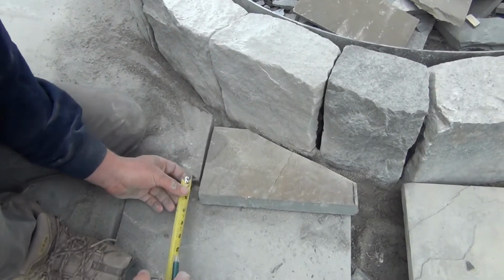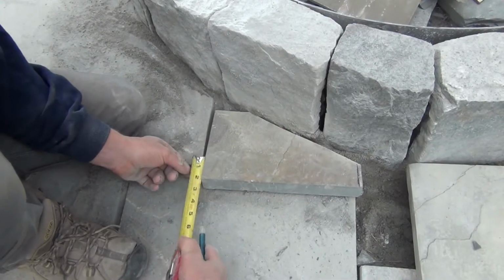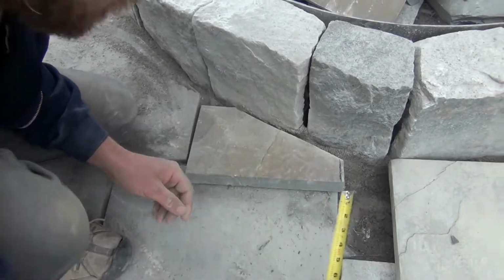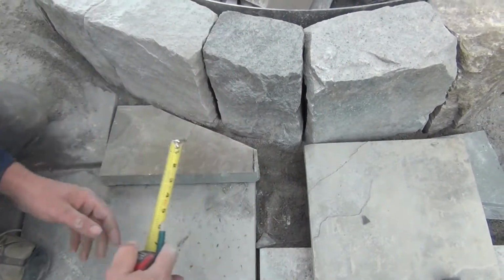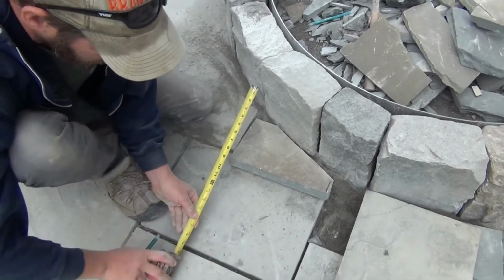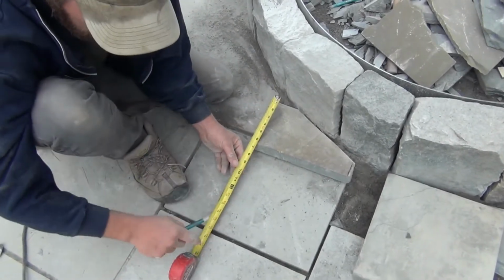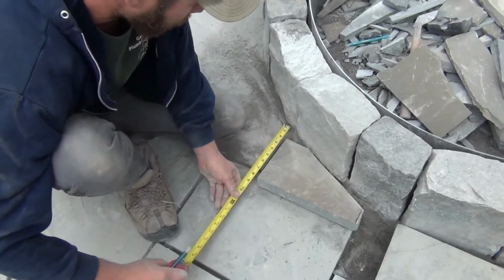If it just went directly in, we'd be right in the right place. So we're going to take a measure tape and measure from the inside of that joint, which is where I want this edge to be. It's exactly 2 inches. I've got it even, so it's exactly 2 inches here. Now if I keep my tape measure, and I pull out a little bit of extra just to keep the tape, so I have a visual line to keep the tape measure parallel with all those other lines.